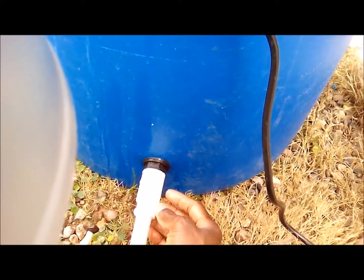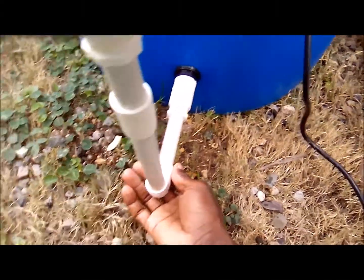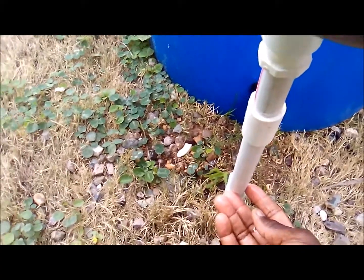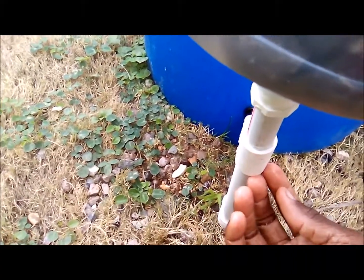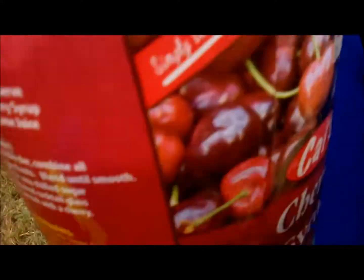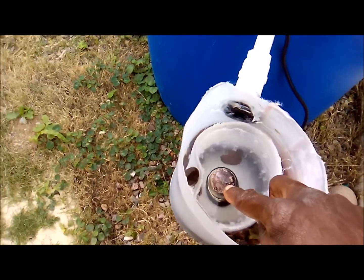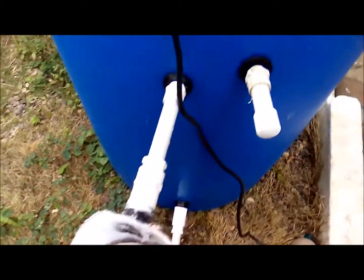The pipe is held in position by a bulkhead. The bulkhead is connected to a female adapter and a reducer — this is a half-inch pipe. My elbow is placed here, which turns the water channel upward. I had to cut and adjust it so it could flush within here. The water channel goes from down below all the way up, through the middle of this container, up to the middle here, through several fine holes, and into the fiber.